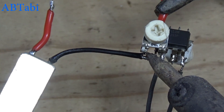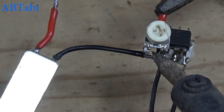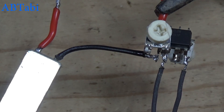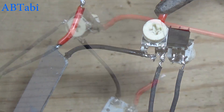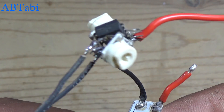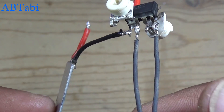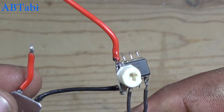I am using an LED light here for testing. You can use a buzzer alarm or relay to control any device. Remember: in this circuit, when the temperature goes up the light turns off, and when the temperature goes down the light turns on. If you want the opposite — temperature up, light on — connect the LED positive side with IC pin 1.